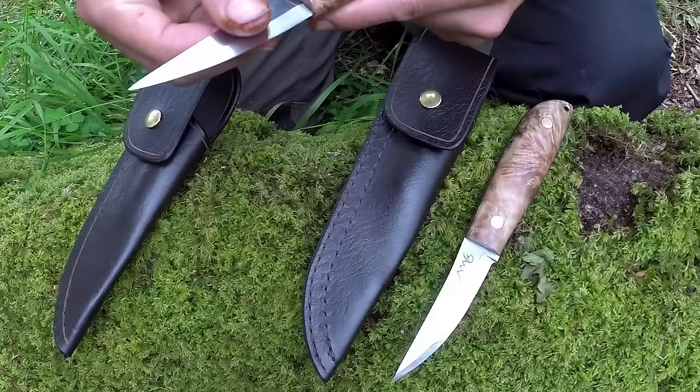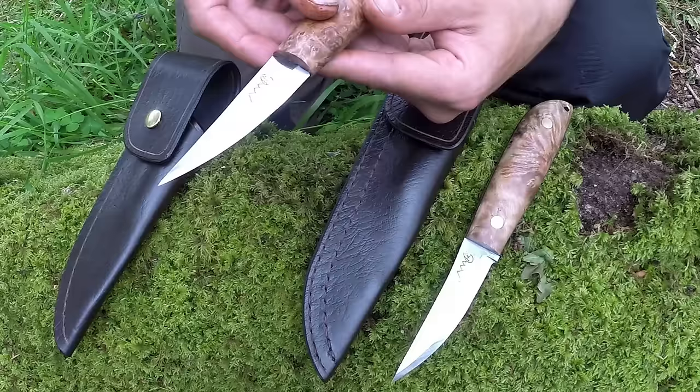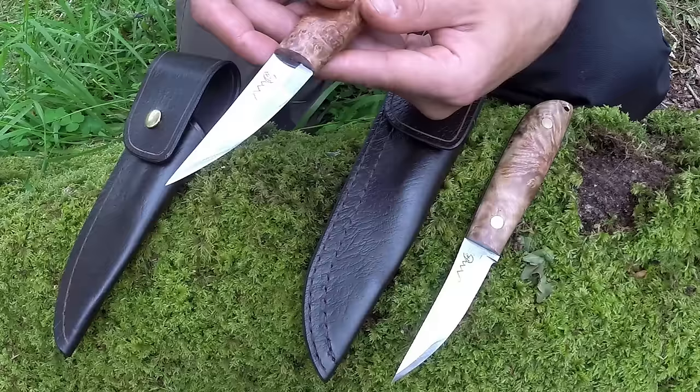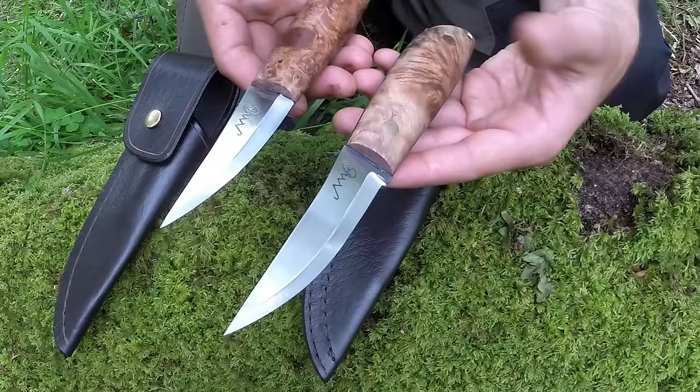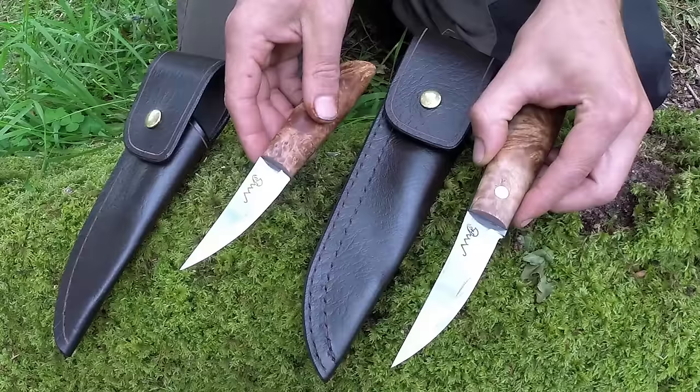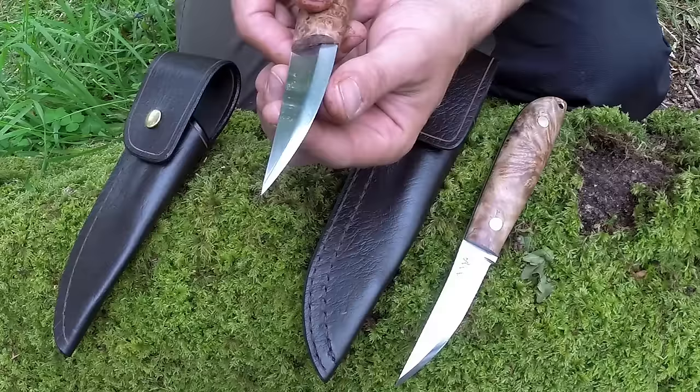And we were talking about it earlier, you really rate that as the... Absolutely. Years ago, I was mostly working in silver steel, that was my steel of choice, but it's only available in round bar, so you have to forge it. And I was given massive bearing races by a friend of mine, and had great fun forging them down. It's difficult stuff to forge, but when you get it down, it's great. It's wonderful because rarely do you get a keen edge with really good edge retention and edge strength. It's almost like the holy grail, and it's not easy.